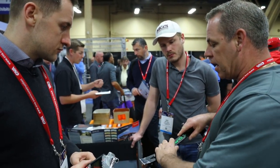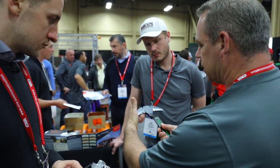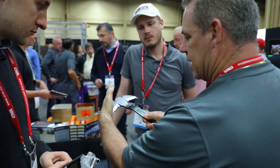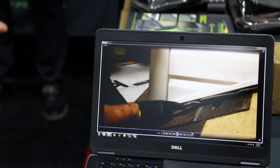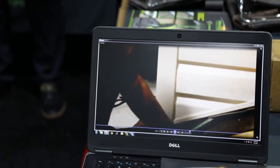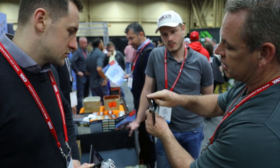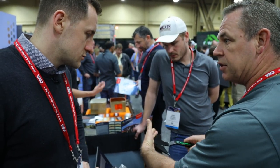Once you know you got it, lift it up a bit. At that point, you turn the extractor head sideways. This is the wall as you're going down — slip it in underneath the siding, hook that nail, and then pull it out sideways. You're using 50% pressure along the wall which holds the step flashing in place. The other 50% pulls the nail out sideways. The flat surface on here, as you can see, is smooth enough so that it doesn't cut the step flashing.